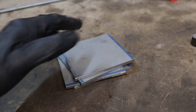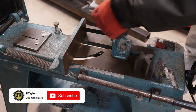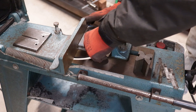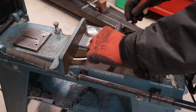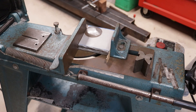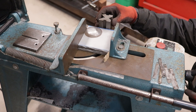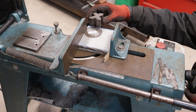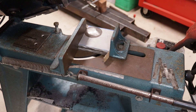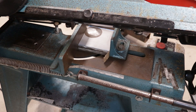So that's my material roughed out, however there are still some jagged edges on the material that I'd like to clean up. What I'm going to do is stack the material in the bandsaw and clamp it up in the jaws - the jaws are going to rest on the nice clean edges. With the material stacked, I'm going to run the bandsaw down all four pieces and that's going to give me a really nice straight cut. I'm going to repeat that process on the other side as well.